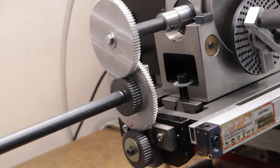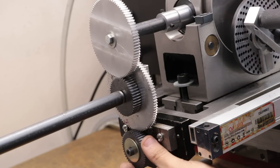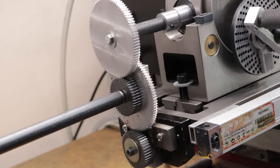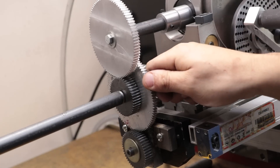And after getting everything properly set up, that is the final result. As you can probably tell, we have the 45-tooth gear connected to the table's lead screw. That connects to the 90-tooth gear, which is keyed to a 45-tooth gear, which connects to a 90-tooth gear. Now, the result of all of that is a speed reduction of a quarter. So because the lead screw is a 2mm pitch, it means we should be able to cut an 8mm pitch helix. Speaking of which, let's see if we can actually make it work.